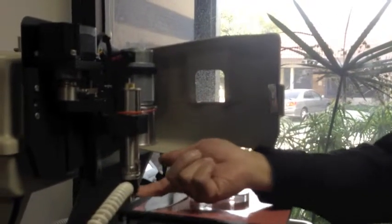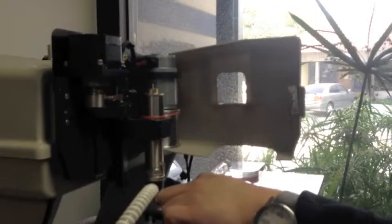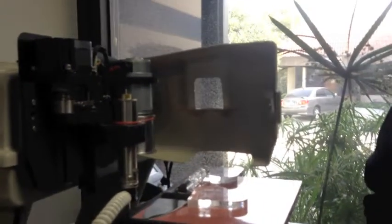We made sure it didn't move. We've set our tool and allowed for clearance if we need it on this particular job on metal, right? Every type of material is going to be different, but as long as you set the material, set the tool, set the home, set the surface, you're going to be in good shape. Okay? So next, we've set the tool, now we need to set home, right?